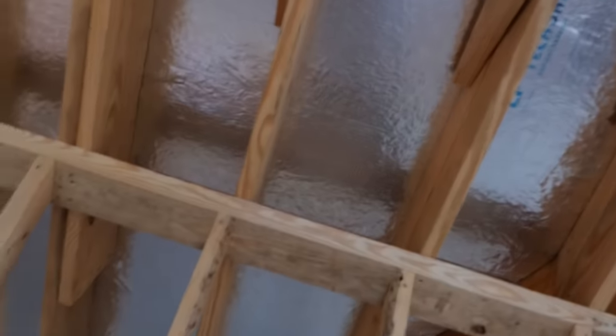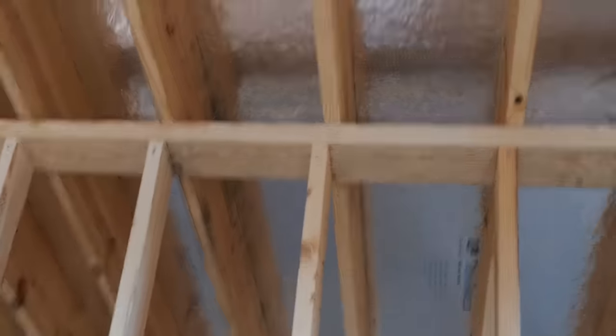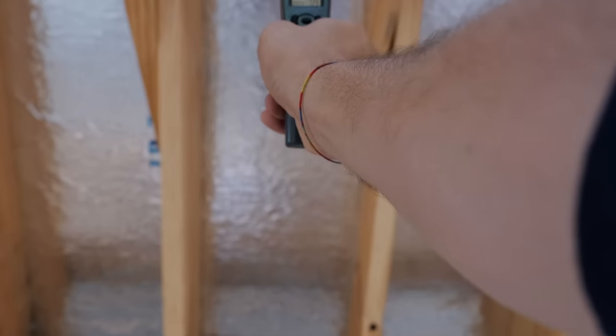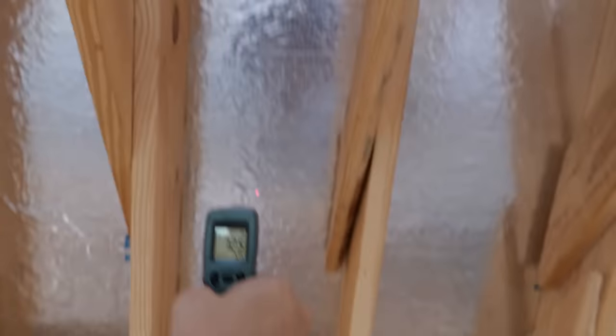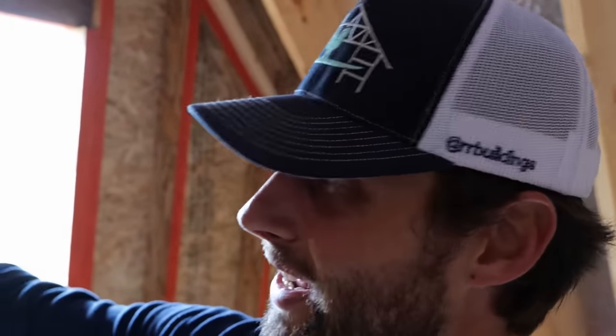This is my roof deck on the same side. I just tested over there on the westerly facing wall. Now I'm going to show you here on a westerly facing roof — and I've got 72 degrees. So we have a 10-degree delta on a day where it's really not all that hot out here. Just imagine what it's actually doing in the summer. We've got a westerly facing wall, which isn't taking near as much radiant energy as the roof, and we still have a 10-degree delta.